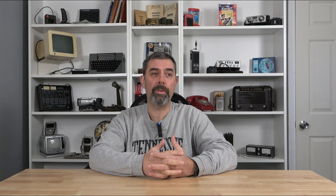My new system is going to be a 48-volt, 500 amp hour system — a very significant reservoir of power. That's going to allow me to power everything I need at my house for eight hours overnight without any issues, and if we have cloud cover it should continue to do so for three additional days. A 12-volt battery at 100 amp hours is going to operate a refrigerator, a coffee maker, or a microwave for a variable amount of time.